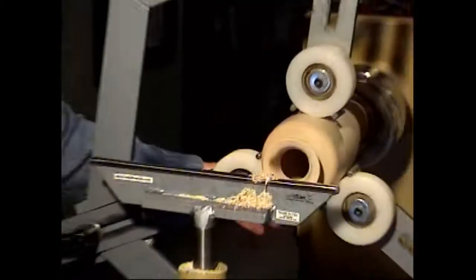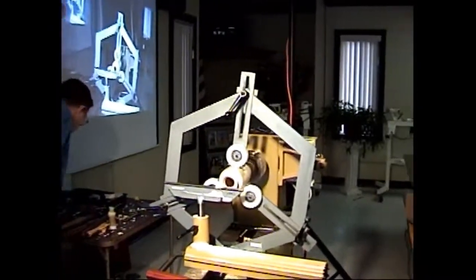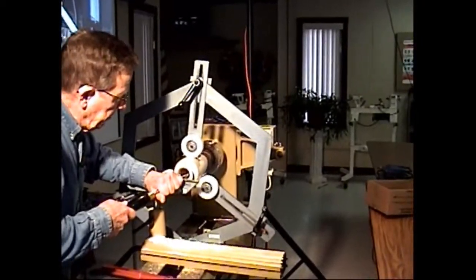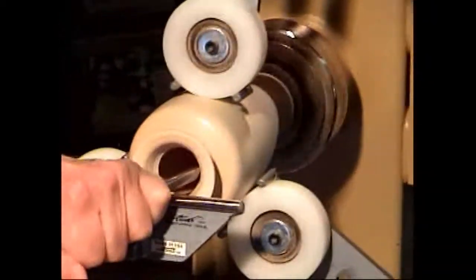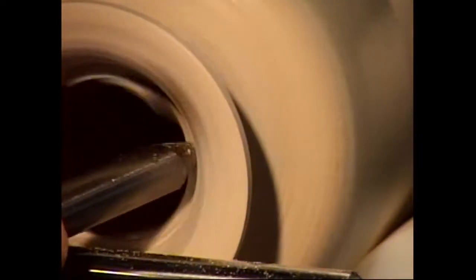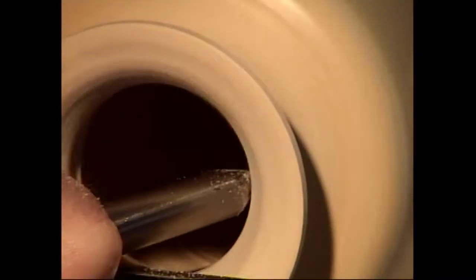Now another thing that I sometimes do, since we have the chuck locked on, is turn it backwards. And if you run it backwards, it is possible to pick up this cut right about here and then push it on in this way and go around that corner to a certain extent here. I've got too much wood. Okay. So you can do that,